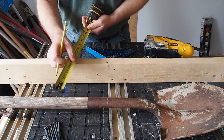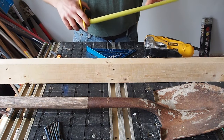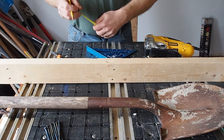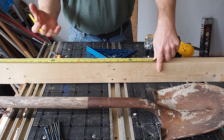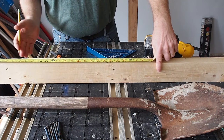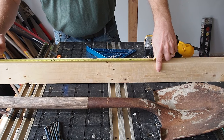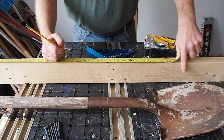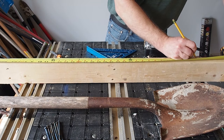This design is based on a typical shovel. The handle of the shovel is less than an inch and a half, so we're going to make our notch in this piece of wood inch and five-eighths. The spade of the shovel is a little over eight inches, so we're going to go ten inches between each notch. This is just a template — once I make all the cuts, we'll use this to mark the rest of the pieces of wood. We have four pieces to cut. I'm going to mark at three inches, then an inch and three quarters above that. The next one's at 13 inches, again an inch and three quarters beyond that, then 23 inches, and 33 — you can make this piece as long as you want.